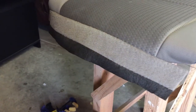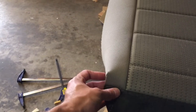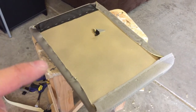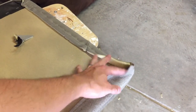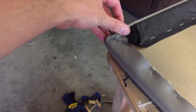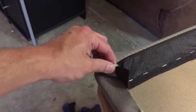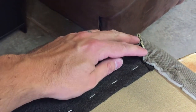I sewed up the corners with an inside stitch — one corner came out better than the other so I'm trying to match that. I made my cuts but didn't cut quite at 90 degrees so there's a little overlap as it comes together. For the back, I ran staples along the edges starting in the middle, then tackled the corners. At the corners you get a lot of extra fabric, so you staple on either side pulling the fabric to a point, then cut that off — you end up with something nice and clean and low profile.